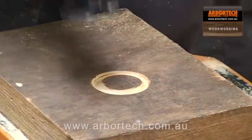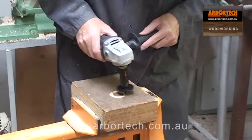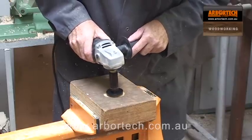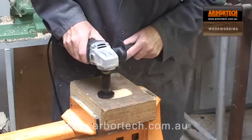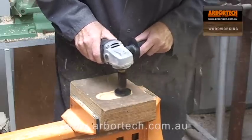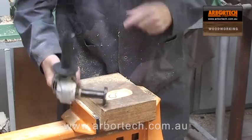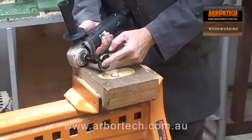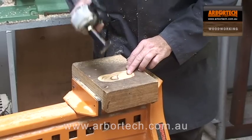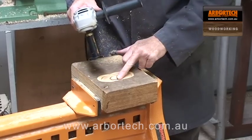The way that this cutter is designed to work is you need to sweep it as you go. So if I want to go deeper, I need to sweep the blade. If I remove the inner portion here, I'll now be able to go deeper. So in effect, this acts as a depth limiter. It actually prevents the tool from grabbing, from trying to penetrate too deep. It sets the depth, and then you can sweep from side to side to remove the material.